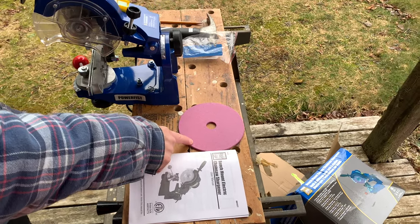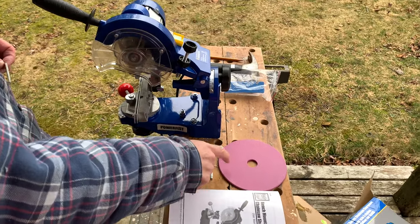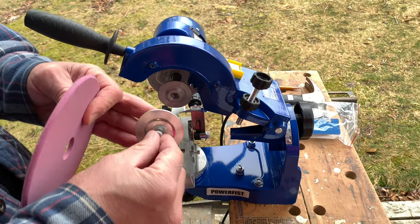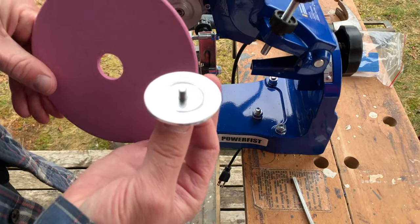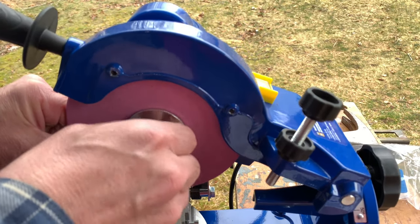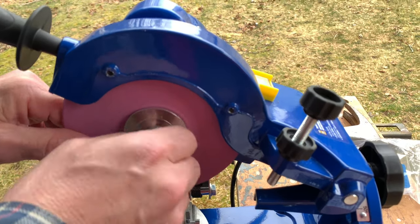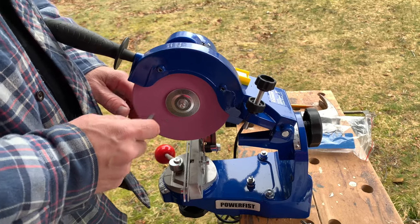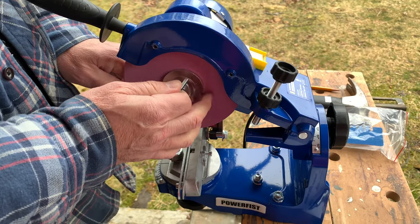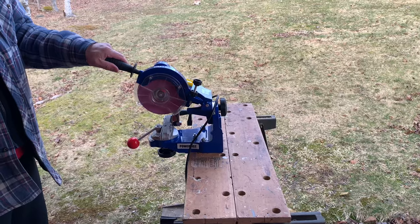There were three discs. I checked the specs on my saw — my chain is 3/16, so that's this one. I'll pull these off and insert this one in here. The outer flange I just took off, and I'll put the grinding wheel in and bring it up so it fits in there nice and tight. I'll tighten this back up and put on the guard. When putting this back on, you want it tight but not too tight, as you may damage the disc. That's just a feel thing — now we'll check it out.